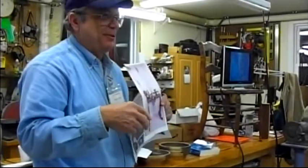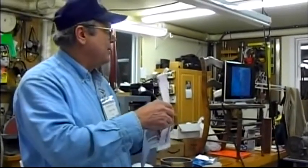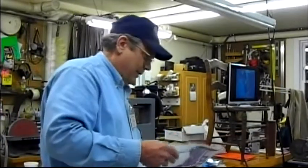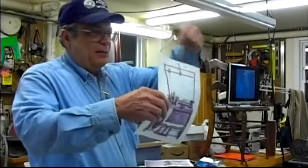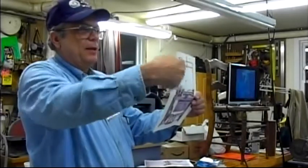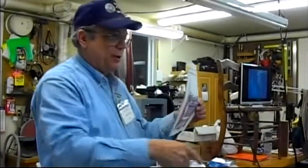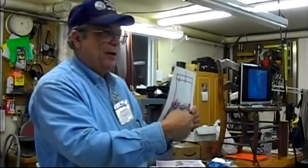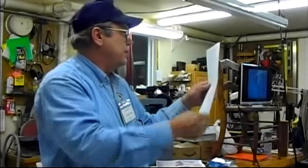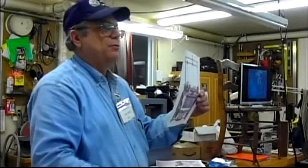These people, I'm telling you, were serious about what they were doing. I don't know if you're familiar with super precision machining. These people were the forerunners of super precision machining. They had looked at everything. And that's the other one. When they would pump this, the belt would run up, go around another pulley that was bigger, and come down to a little tiny pulley. So you're speeding this little cutter up, seriously. They don't have a tool hooked up on this one. That belt right there went down and hooked into their cutting frame that spun the tool.